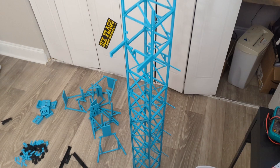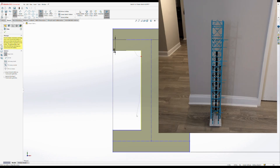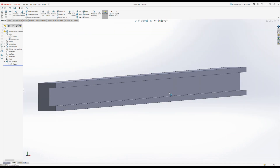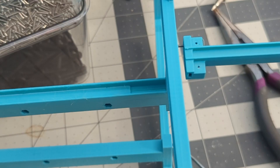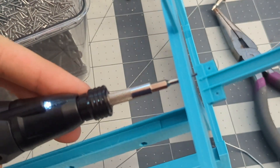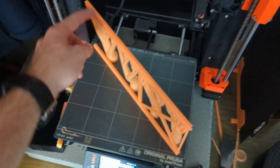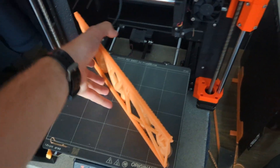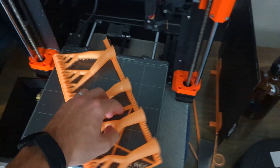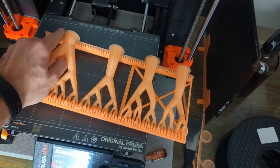For the model, I chose to design and build it in four sections to make the parts more 3D printer friendly. To keep the same look, I created a U-shaped section that fills in the bottom of the I, so I can print these sections flat against the print bed and reduce support material as much as possible. I can then face two parts together so that from a distance the model still looks like it was built with I-beams. I designed the tower to be printed in two large parts — a front face and a back face — joined by additional cross members. Each section is 300 millimeters long, which is a little challenging for my MK4. To fit the pieces I have to print in a somewhat cursed orientation, and if I had a larger printer I'd print it face down, but I don't. Thankfully my manager at work has a five-tool-head version of the Prusa XL and agreed to print the larger parts for me.